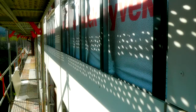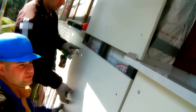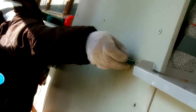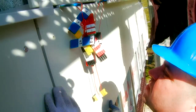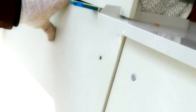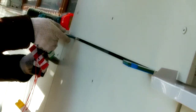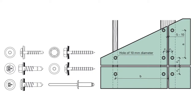After the grid is installed, the Cetris boards are laid. The board manufacturer, Cidem Hranice, is able to deliver the boards cut to desired size with pre-drilled holes and rounded edges. In the Vario system, the boards are always laid so that the vertical and horizontal gap of a minimum width of 5 millimeters is granted. When using 3350 millimeter sizes, the maximum width of the gap is 10 millimeters. In facade design, the most commonly used uniform width of the joint is 10 millimeters, regardless of the formats. The Cetris boards are fixed to the auxiliary profiles with screws or rivets.